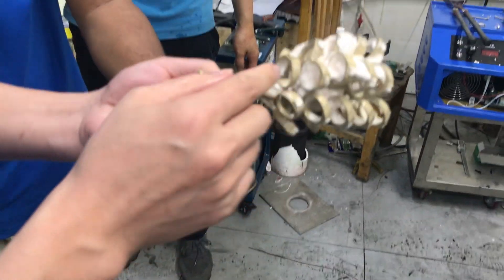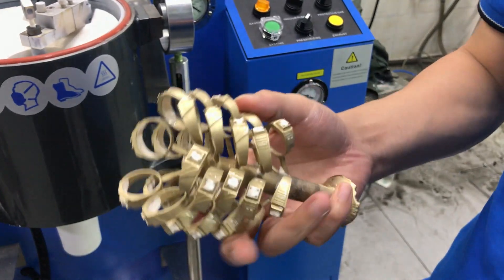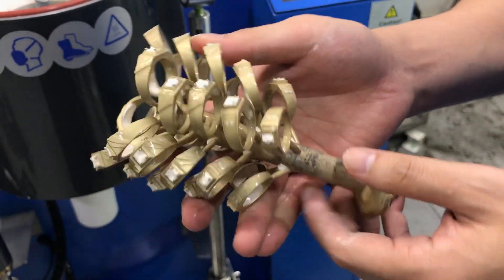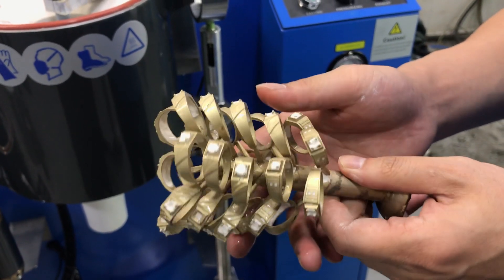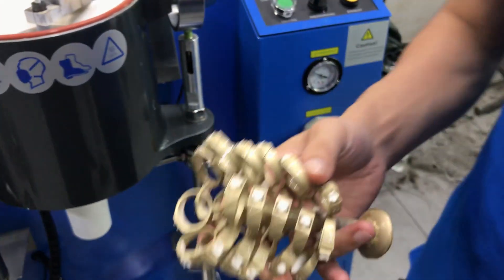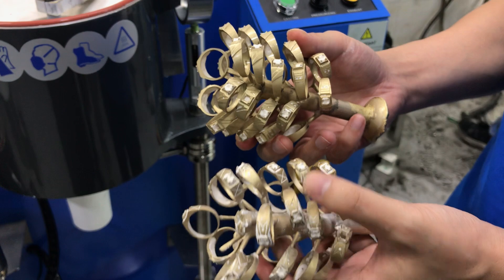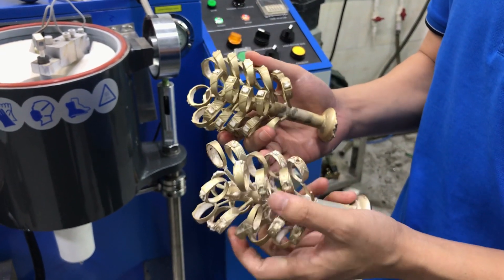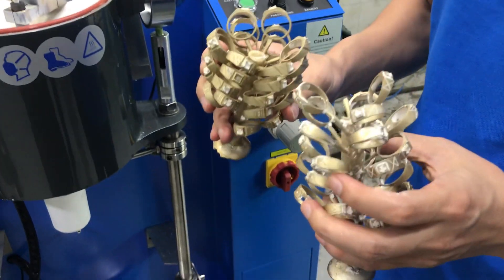Let's check the finishing. This one is very good. After cleaning, see the finish — the surface is very smooth, the details are very clear. Finishing is very good: no oxidation, high density, smooth surface. We already made 2 pieces by casting. For 22 carat or 18 carat gold, the finishing will be much better — high density and a shining surface. So that's our casting machine. We give warranty about the quality.